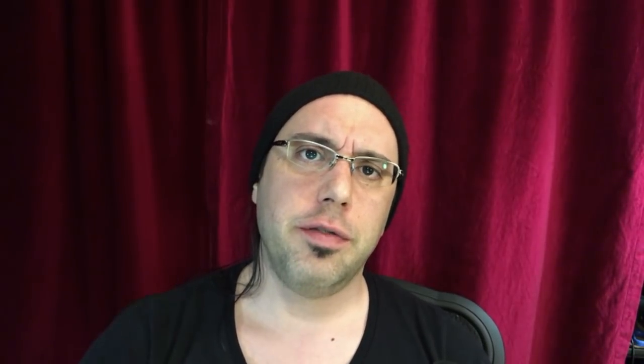Different metals have different resistivity — that is, how much they impede the flow of electrons. We went through Ohm's Law in previous videos, so the calculation of concern right now is power equals current squared times resistance, and the resistance is going to be key. Each of these blocks has plug connectors at the end, as well as clamp connectors for the input, and a screw terminal on top. The material of the screw terminal isn't crucial, but the material of the pins and the clamp — that's vital.